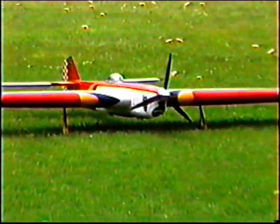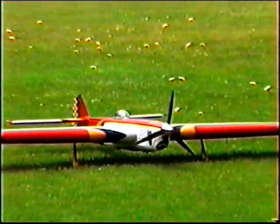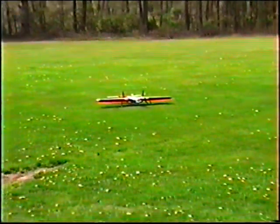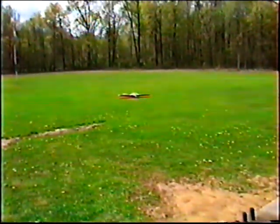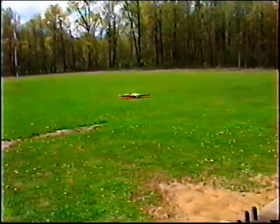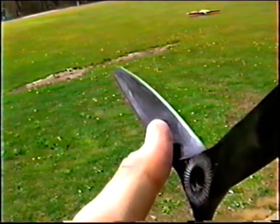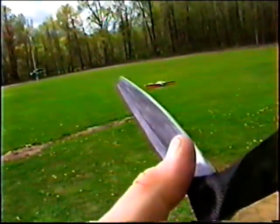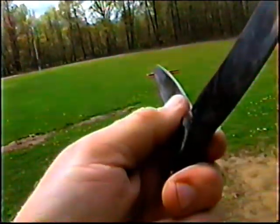But again, I think part of that is because the blades are thin. Whatever the reasoning is here, and wherever we've crossed over the line, what we have is a phenomenon that I need to think more about before I make any final decision. But I've put a lot of good data in the bank. Now, on George's prop with all the undercambering, I may need to add pitch so that it is equal. Billy's prop doesn't have the undercambering and it drives better.